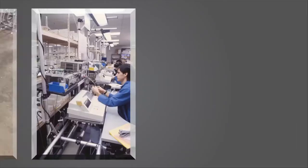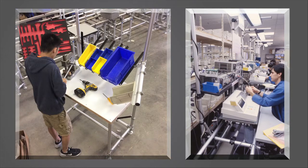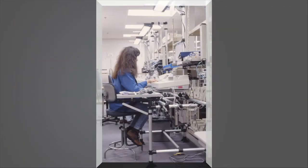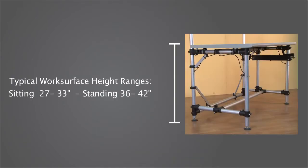Size up the task. How can the station be made comfortable? Do you require a sitting or standing height station? Fine work may require a sitting position, possibly with armrests — this is usually a 30-inch surface height. Larger and progressive assembly typically requires a standing height, 36-inch work surface for maximum reach and mobility.